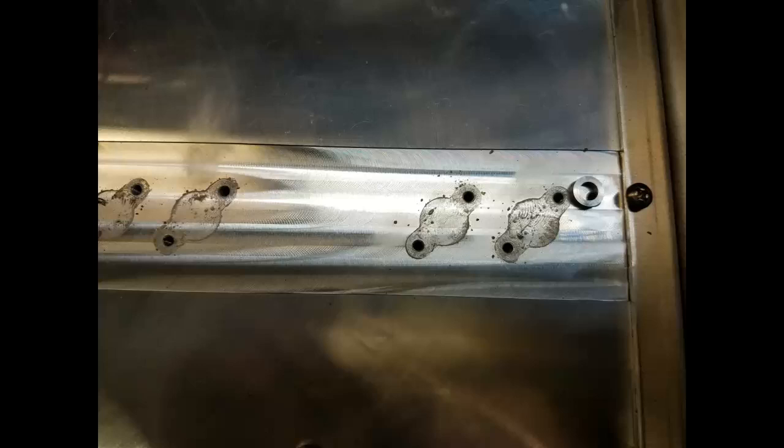There are thousands and thousands of ridges along the heat sink, and between each ridge there's a valley. Even if you fill it with heat sink compound, there's a lot more thermal resistance than if the transistors mated metal to metal. The bottom of the FETs is actually made slightly convex so the center makes firm contact with the heat sink when the flanges are bolted down — but none of that helps when the heat sink surface is rough. That's a major problem getting heat out of the FET regardless of what compound you use.